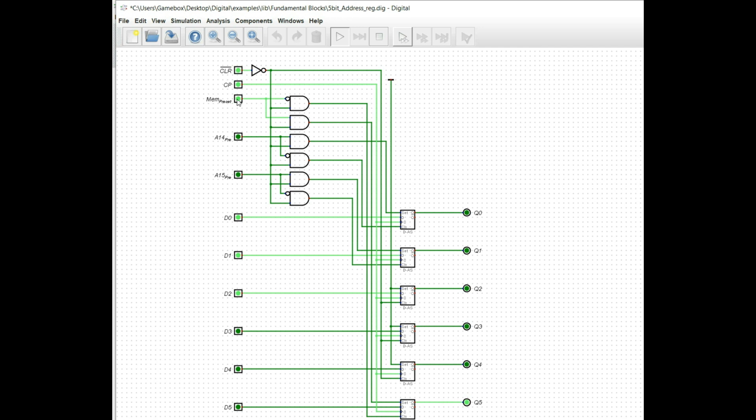But the fantastic part about doing it this way is that I can set this after the fact. Let's say it's initialized as being a 0, so this area of memory would normally access the ROM. If I go ahead and set bit 5 high and have a couple bits here set to denote a particular address range, and I clock that data in, I've got my address range here, but I also have my extra bit for determining whether it's a RAM or ROM. So at this point it would access the SRAM at this page here.